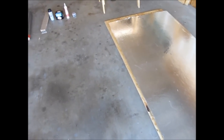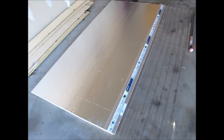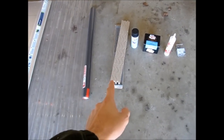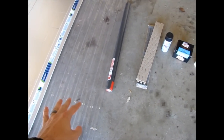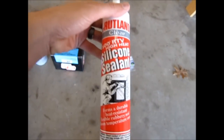As with any construction project, there's probably a hundred different ways you could build this with different materials, but here are the major things we need. I've got two 8x4 poly iso boards, which are sheets of foam with aluminum foil on one side. I've got polycarbonate roofing material, 8 by 26 inches, and a big roll of window screen in charcoal color or black.